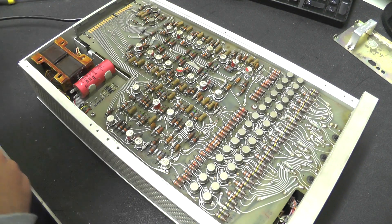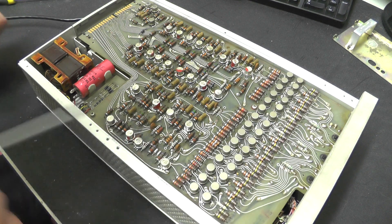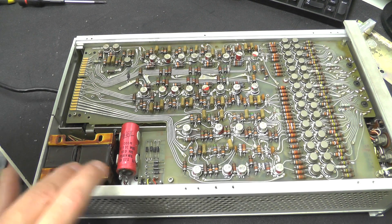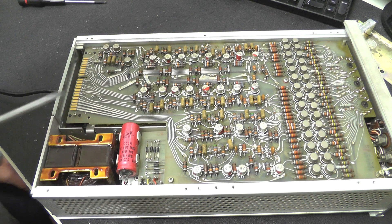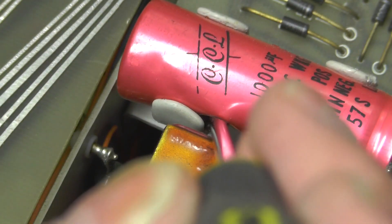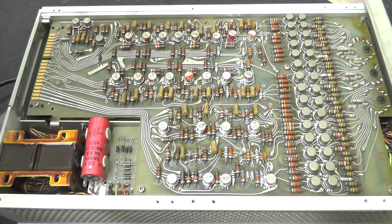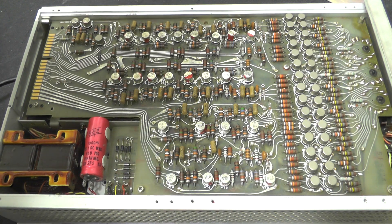Wow, that's a lot of transistors. I'm guessing, judging by the layout of all these here, these are the transistors which actually drive all the Nixie tubes — you can see the traces coming over, you can just see the outline of the packages, the tubes just here. Down here in the bottom corner we have the other side of the transformer, we've got another filter cap with some quite serious dents in it. I wonder whether someone tried to lever that out and they've deformed it. Right next to there we have two bridge rectifiers. Wow, don't these PCBs just look so organic with the lovely sweeping traces — everything's all just so analog.